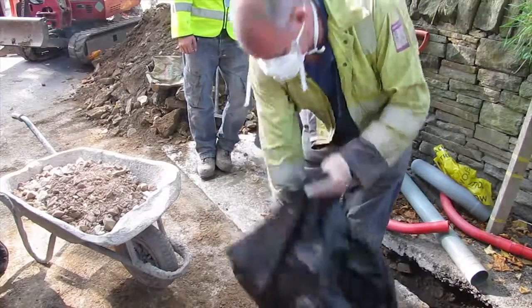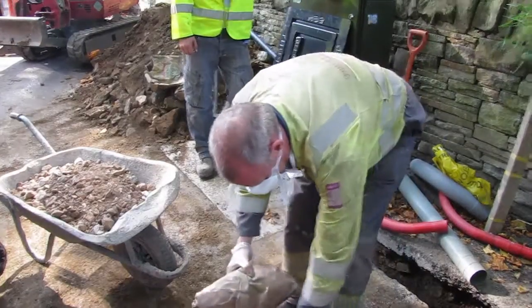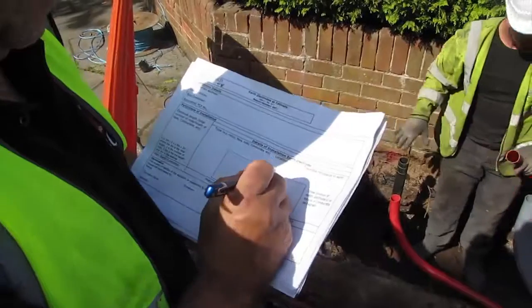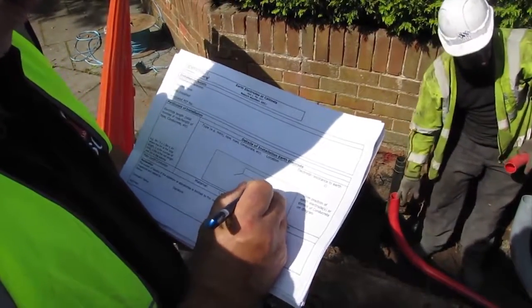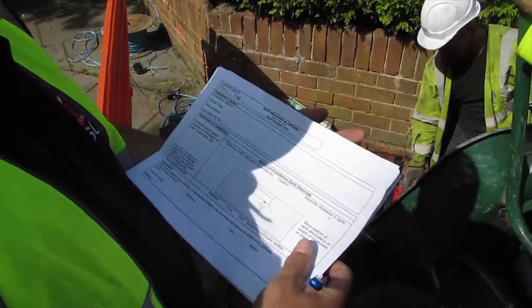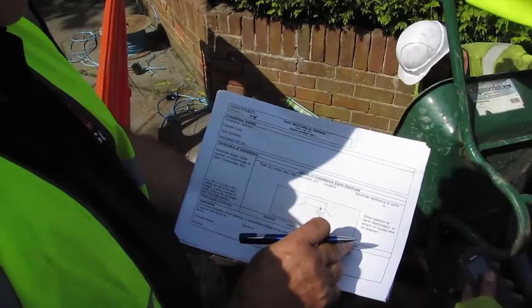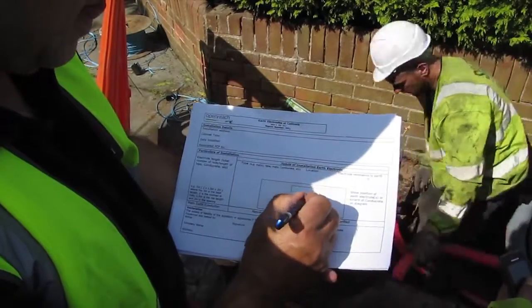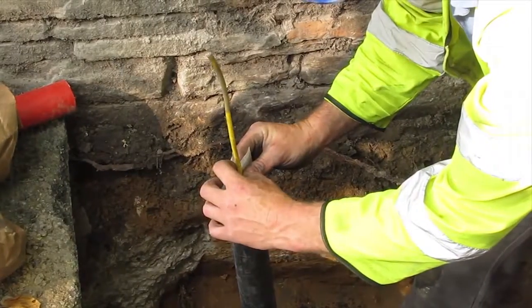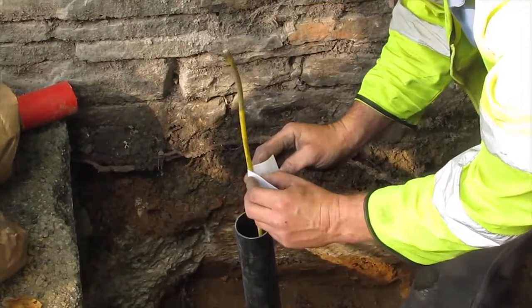Remove the empty bags after use as per regulations for bags of ordinary cement. Ensure that the A55 earthing electrode document is completed, showing the location, length and direction of the copper tail and whether both tails have been used. Ensure the location of black duct 36 is noted. Please also ensure that the label provided is placed on the insulated earth cable.